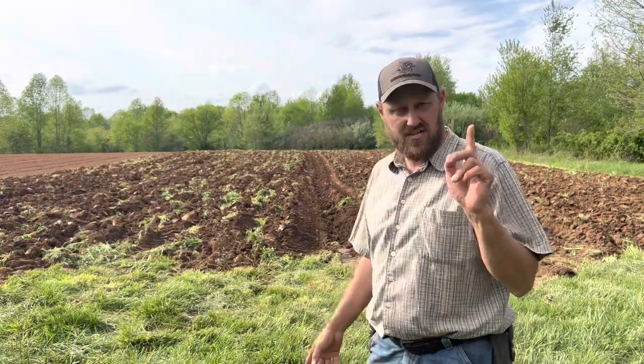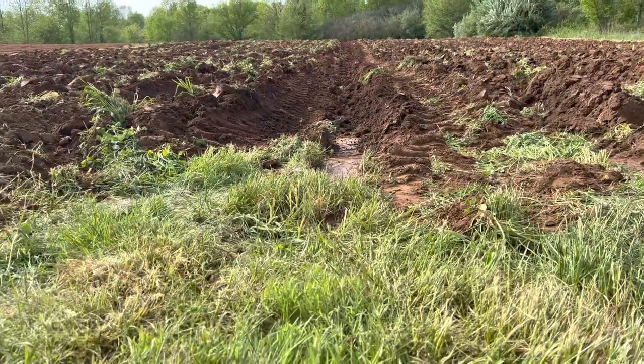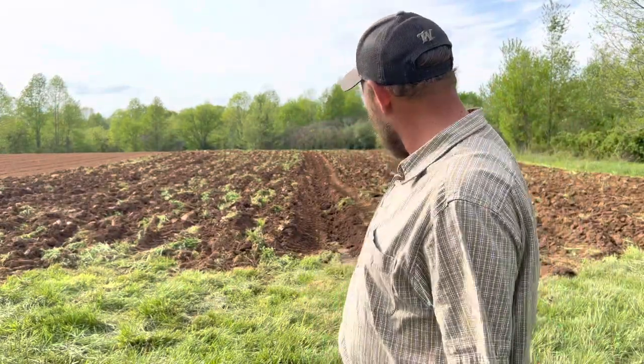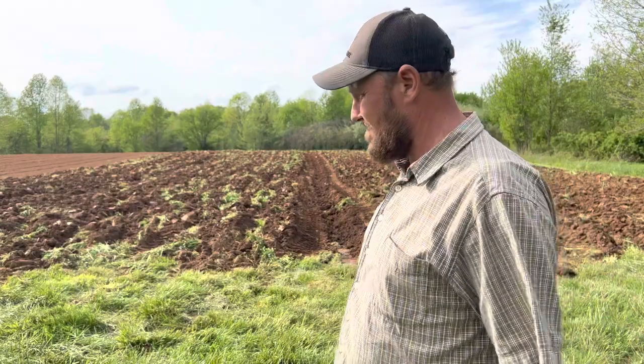I got this field knocked out. As you see, plowing out has a disadvantage — the disadvantage being that you have a dead furrow in the middle when you finish up. You definitely don't want to do this multiple years in a row because you will have a pond in the middle of your field. Next year I need to plow in to fill that back in. I'll be using a tiller out here and I'll be able to fix a lot of that with the tiller, but not all. So let's go on to the next field — I'm going to show you how to plow in. You don't have that issue; instead your dead furrows will be on the outside edges.